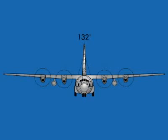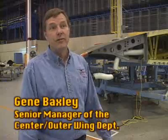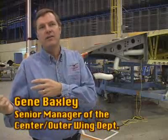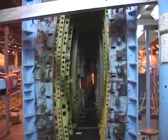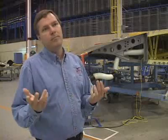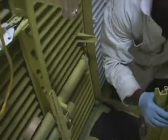The C-130 has a wingspan of over 132 feet — to give you an idea, that's three and a half school buses long. People think of the wings of an airplane as one wing, but it's really three wings: a center wing that attaches to the fuselage, and a left-hand and right-hand outer wing. The wings are essentially a set of ribs with strong support beams covered in a rigid skin. The ribs and support structures are carefully constructed in jigs, and then the outer shell pieces are drilled with holes and attached with fasteners. One thing a lot of folks don't know is that the wings are actually fuel tanks — that's where the fuel for the airplane goes. During this phase, the fuel tanks and wing flaps are assembled and installed by mechanics.